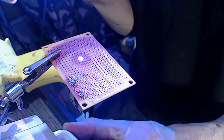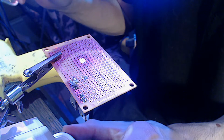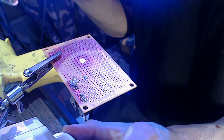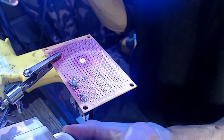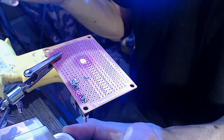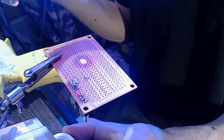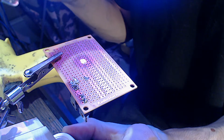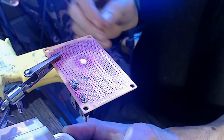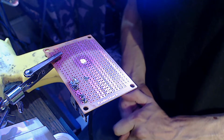Pulse width modulation is what PWM stands for, and what it does is it oscillates or blinks a DC voltage and current at a frequency that the human eye cannot tell is actually blinking, and so your eye will see it as being dimmer. Like, say, if you have red or green or blue, you can go through that color spectrum with all those three colors, and you can see any color based on how fast that PWM is cutting in and out of the waveform. I know that's something a lot more complicated than what's usually on this channel, but...